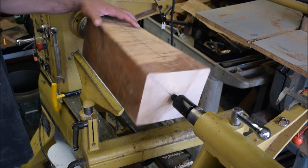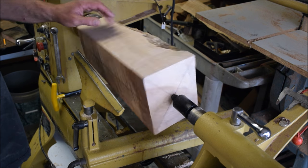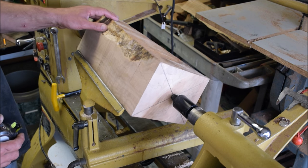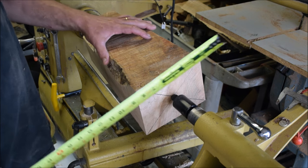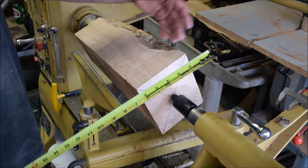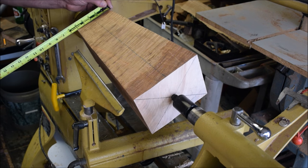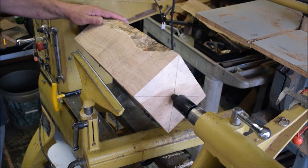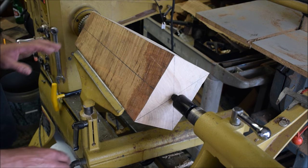Here's this chunk — it's a trapezoidal chunk that I just kind of roughed in. It has some natural edge over here that I will be getting rid of. There are some really big splits running through this piece, but starting out at about 16 and 3/4 by 7 and 1/2 by 6 inches. I'll probably end up with like a 5 and 1/2 inch tapered cylinder. This end is about 4 and 7/8 by 6. So I'm going to start by roughing this into a complete tapered cylinder.